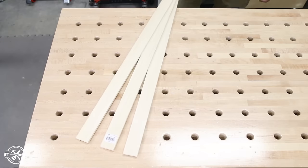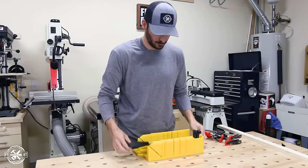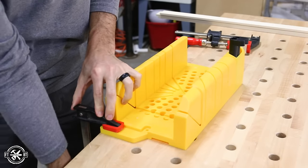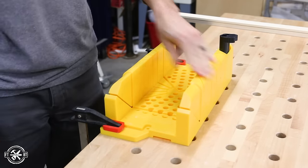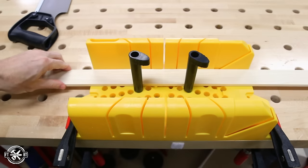The lid racks are made from quarter inch strips of poplar that I got from Home Depot. Each piece is an inch and a half wide and three feet long, and three of these cost under $5. I'll be making the cuts for all of these projects with this miter box and saw I picked up for $14. It clamps or screws down to a work surface, and it has these cool cam clamps that hold the workpiece in place while you cut it.